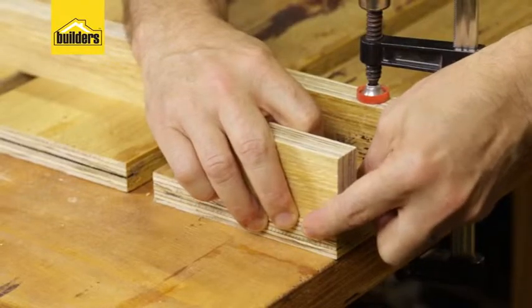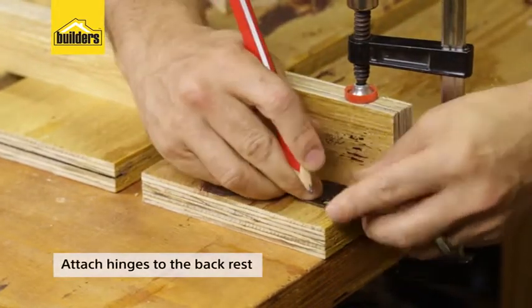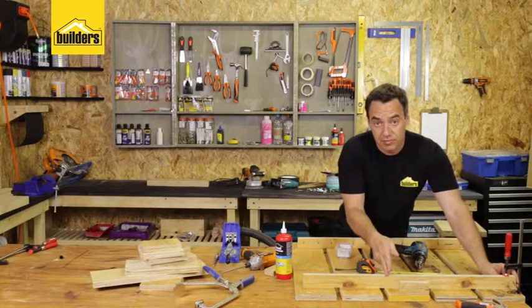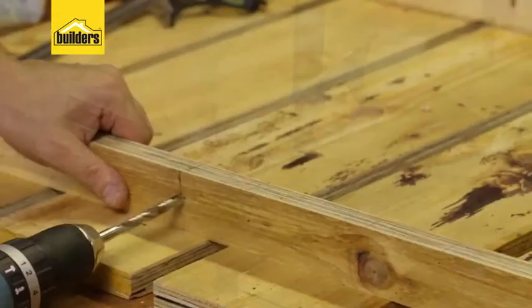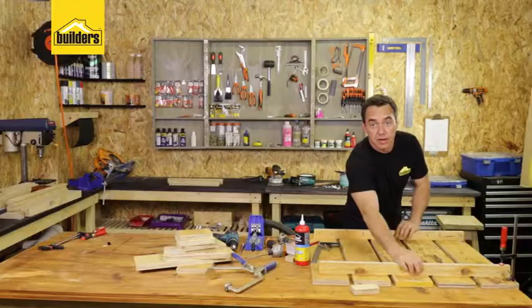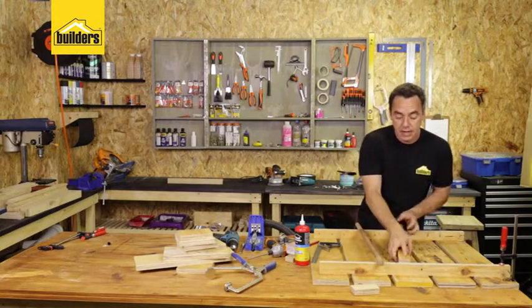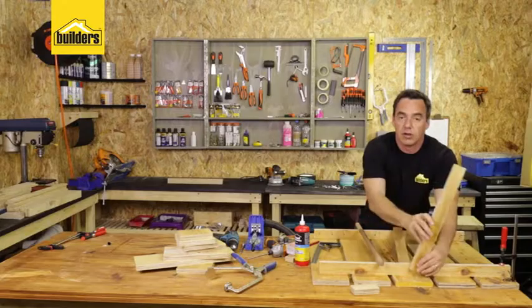I've used two backflat hinges. Remember the backrest overhangs over the edge of the box frame, so you're going to have to allow a spacer before you put your hinge in. Do exactly the same thing on the other side and screw it in. I'm going to go 355mm to my pivot point, the adjustment bracket, and go down 20mm. I'm going to drill with an 8mm drill bit because I've got an 8mm bolt which is going to clamp the pieces together. For the ratchet lever mechanism — the height adjustment on the backrest — I need a 22mm hole on the end, and I'm also going to round the edges so it rotates smoothly and doesn't catch the base.